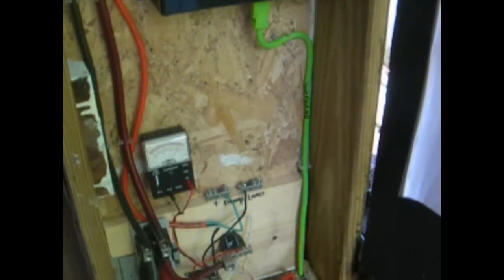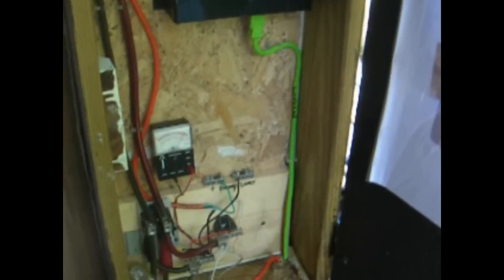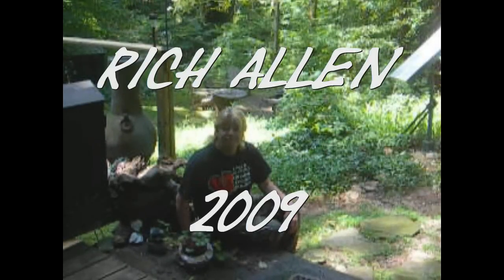Since I'm not really going to be using this system much — only for emergencies — once the battery's charged, it should in theory be dumping most of the time. So I'd like to put a grid-tie inverter in here and actually send that back into the house. You can buy a small one, like a 250-watt one for $300 and something. And I'd also like to add a wind turbine. But for now, this is my system. That's it for now — thanks for watching. Stay tuned, watch my videos. Bye.